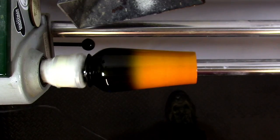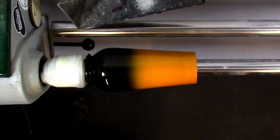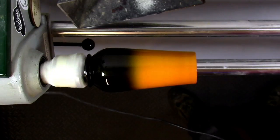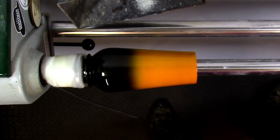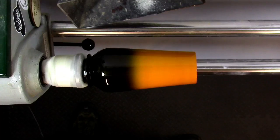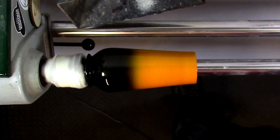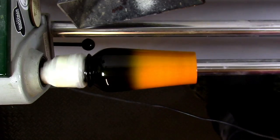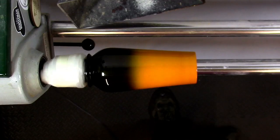What we need to make sure we do is that we don't overheat the lacquer, because if we do, the lacquer will start to lift off of the embellishing wax, because obviously it's a lacquer over a wax. So if we generate too much heat on the lacquer, it will lift up and start to come off our piece, which is what we don't want. So it'll be a nice gentle buff, just to bring it up so it's got, like I say, that mirror finish, which is what we're looking for.